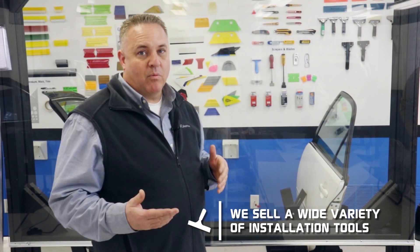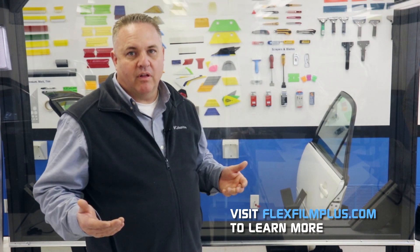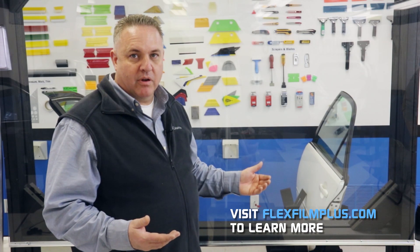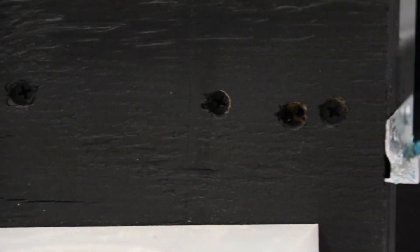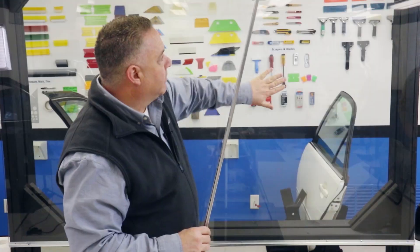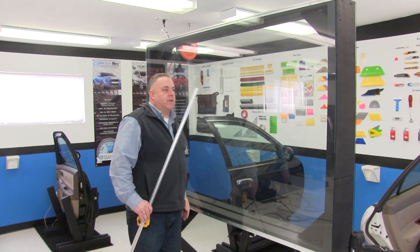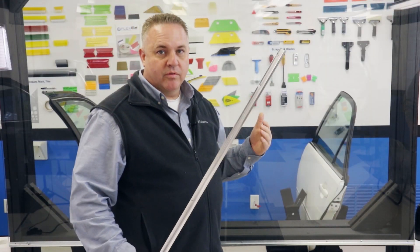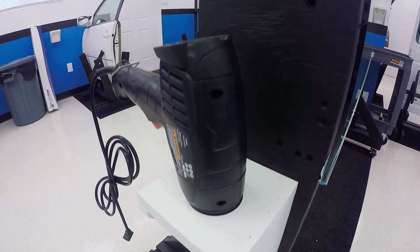Plate glass can be kind of dangerous. I could have used tempered glass — it's a lot more expensive, but it would have probably been overkill. I have a good glass company that I work with; they deliver the glass and put it in. I also decided to use tracks I bought at Home Depot, nailed to the bottom, and we literally just slid the glass in. I put a little soap in it and it's really secure. I decided I wanted the height to be about where my nose is, in the middle of everything. If you're really tall or shorter, you could certainly adjust that. We also used three-quarter-inch plywood on the edges to sort of tie everything together.